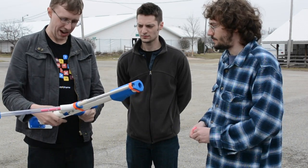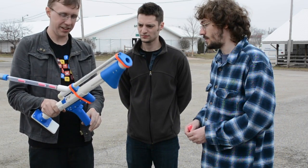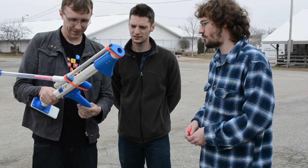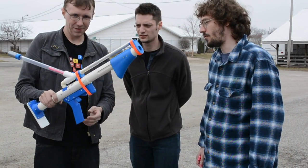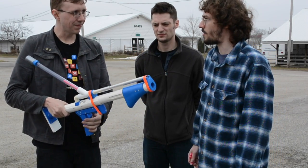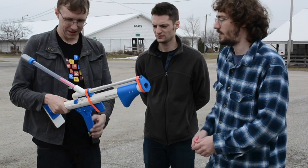If you wanted to print this at home, you're probably looking at like an 8x8 — you could probably do 6x6. The trickiest thing is these tall prints. That's about a little over 5 inches tall, and this long print right here is also an issue with warping. Tall prints are tricky because you have to have very good layer adhesion so you're not just going to crack off the handle.